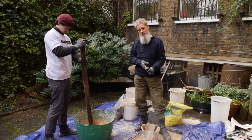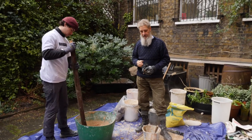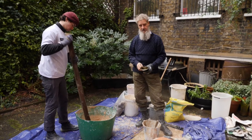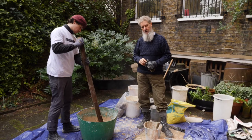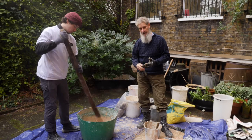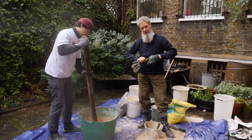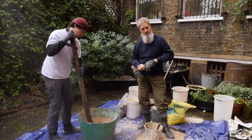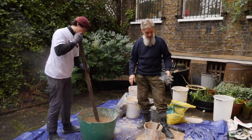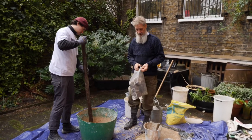We've made a mortar mix for bricklaying from both a lime putty and from a hot lime mix. Now we're going to make a base coat for plastering. We've got sharp sand here, which is fine for a base coat. When you go to top coats you use finer sands. For this base coat we're going to add some hair to act as a binder.